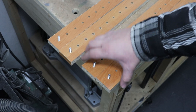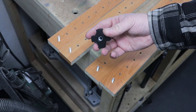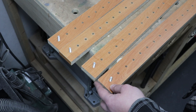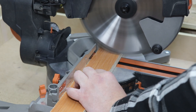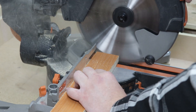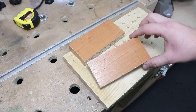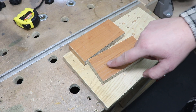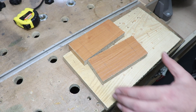Now we're going to cut out two pieces, one for each arm, and we're going to secure them with some star knobs on top as we do want to have free movement in these parts. The size of these blocks are 13 centimeters long and six centimeters wide, and I've just marked the places where the holes need to be for the bolts.